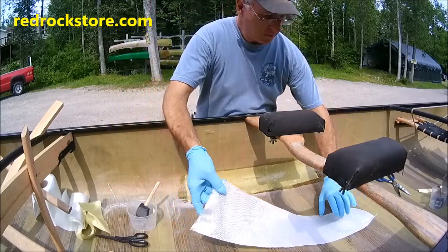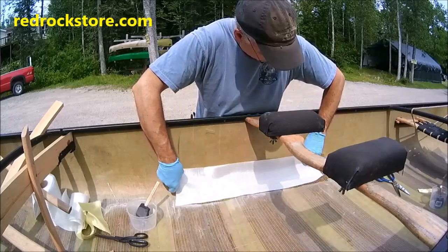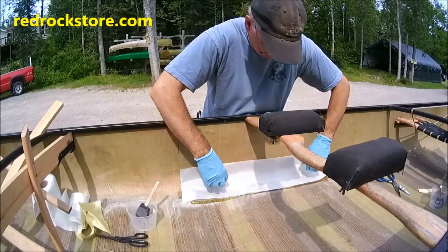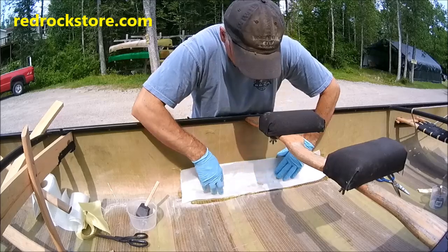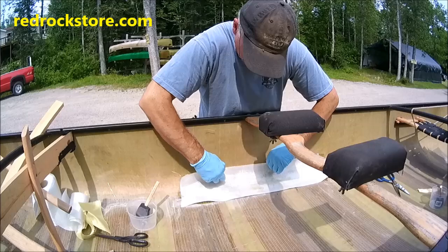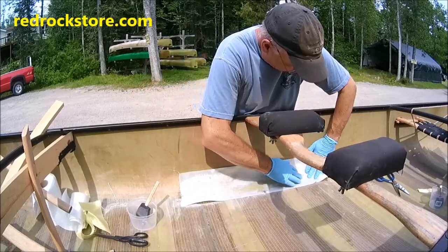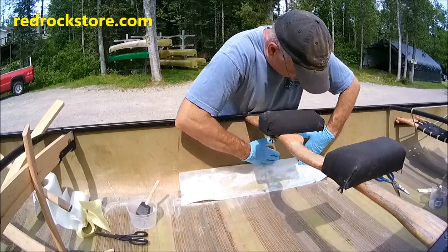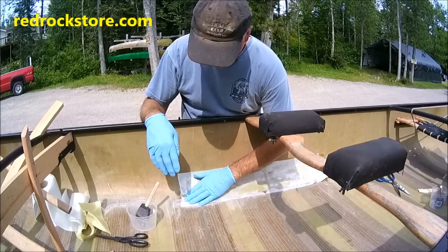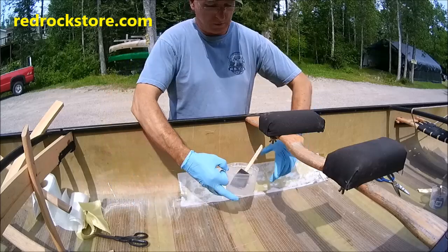Now I take this piece, which is the fiberglass layer. We're going to set that over the top. And look at where we're going here. Lay it down. Stick it into the resin we did. Make sure we cover up all the Kevlar that we put down, because fiberglass actually resins out a little nicer. And again, we're going just along the tops of the ribs. I don't know if you noticed, there's a tremendous amount of precise measurements that are going on with this.